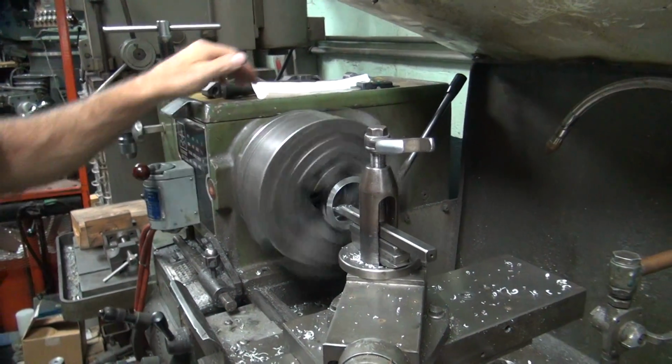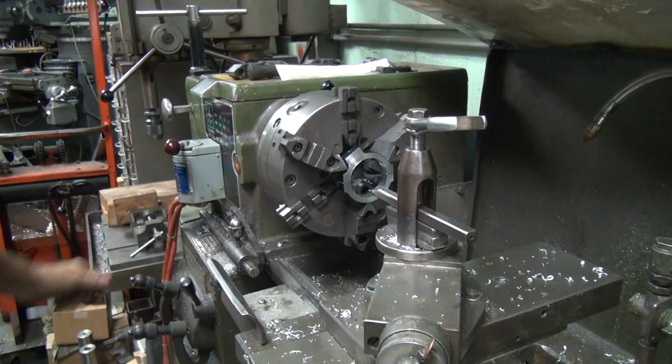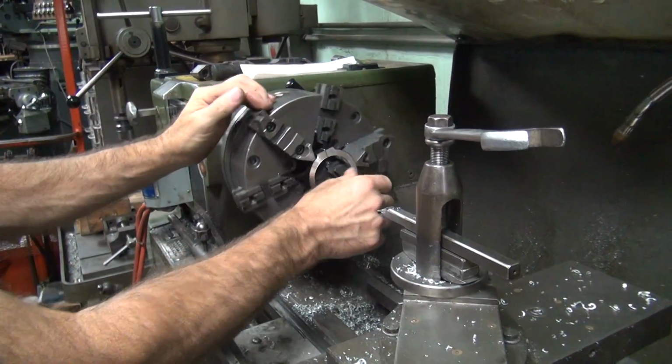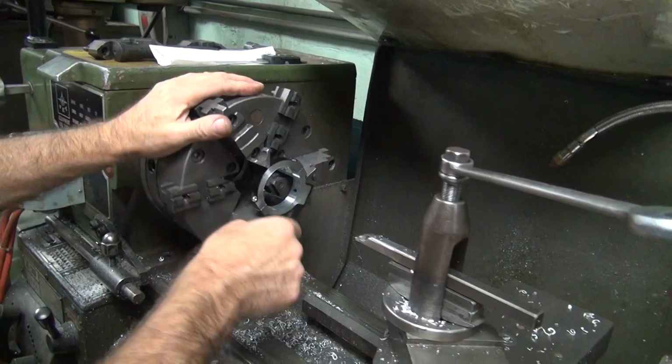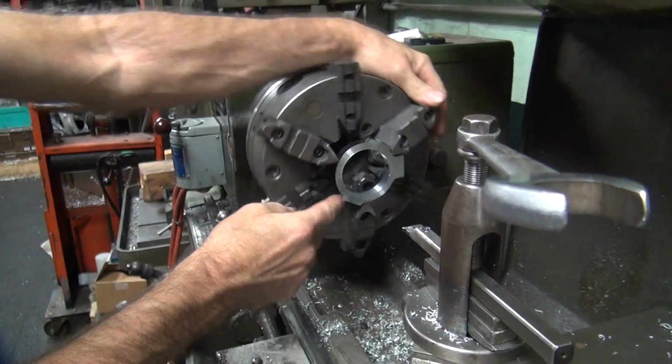So all that stuff coming back is just high spots. Chip load too. Chip load is how much you're flexing that bit with the load on the cutter. Gotcha. We don't know how much chip load this cut we're doing. That's a nice finish. Yeah, but see here it's not. It's better on this half. See, this half finish works better than this half.